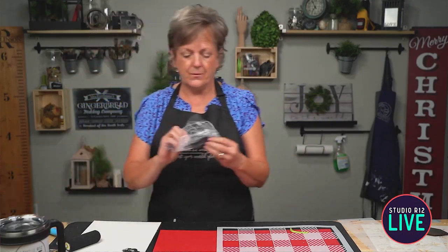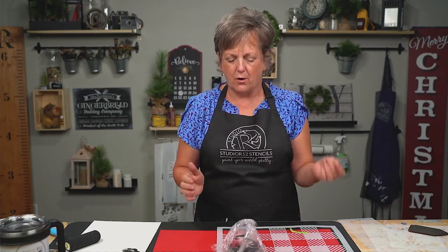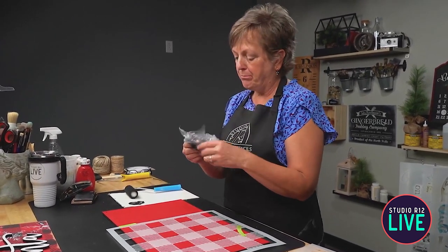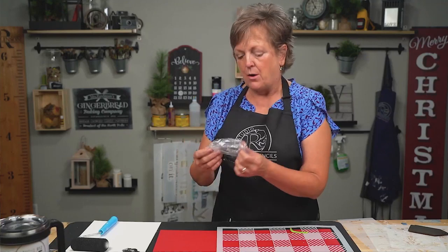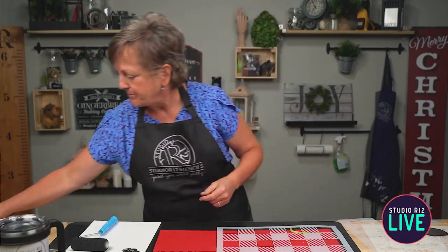When you clean your roller, you just pull that off, and then it's almost like milking a cow — you squish it under running water until everything runs clear. Then you put it aside to dry off of the roller, and put it back on when you're ready to paint again. That's how you save a roller — you can use these rollers for a long time. Also, if you leave your plastic bag open, paint dries when it oxidizes with air. So if your paint is exposed to air, it's drying. If you get little black plastic dried bits in there, that's going to stick in your paint and go on your surface — not optimal. Make sure your bag is either shut or use a fresh bag.